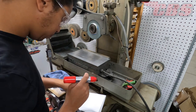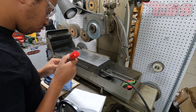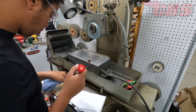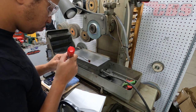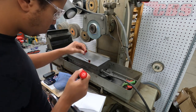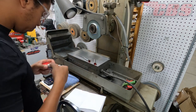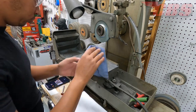A customer sent me in two lifters and basically what I was doing is inspecting them. I put some red dye or magic marker on the end of the pad — the Stellite pad — so we get an idea when we're regrinding them of the wear patterns and how the new radius is coming into effect. In this video we're going to show that, and I'm doing a voiceover as you can clearly see.